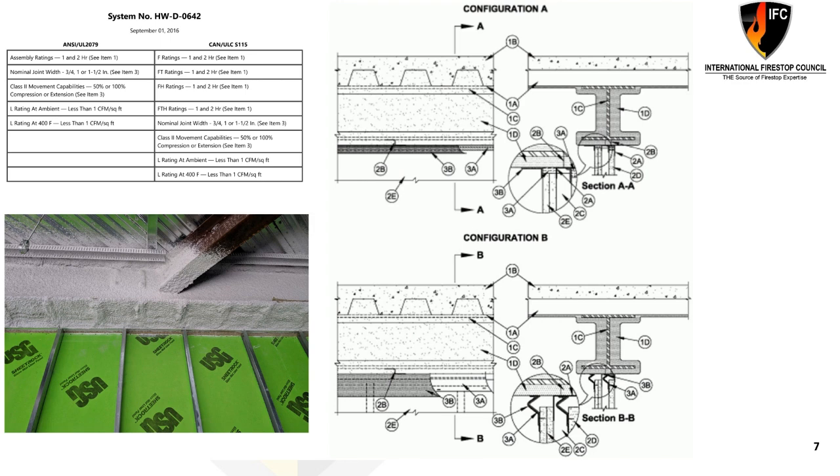Today we selected listing HWD0642, and we've taken some snapshots of the actual listing from the UL directory to walk through it and give you some good ideas of what may be found there. One thing to remember is that you're always going to see a listing nomenclature. In the UL guide you'll find that HWD0642 means head of wall design, dynamic, with a joint less than or equal to two inches, and the 642nd test of that type done. There are over 600 listings to pick from for a typical fire-resistive joint at a head of wall. Our focus is to say that's been properly selected and approved by the authority having jurisdiction — so what goes into reviewing these documents?